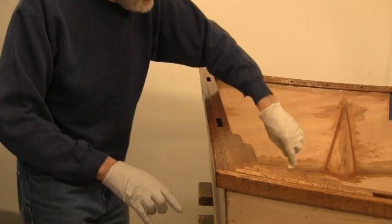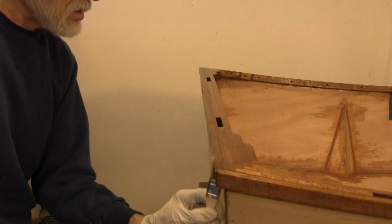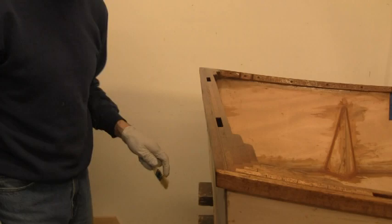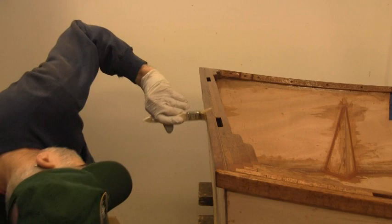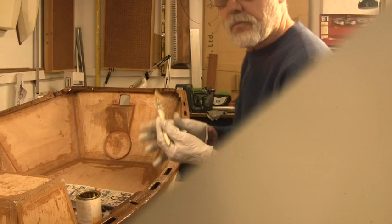When I get the little Milwaukee out with the triangle, I'll do some sanding on the parts where I may get some rundown from this spar varnish. Hopefully if I can drag it back and forth enough, it won't drip on me. I'll give it another two, maybe three coats total. There's only so much fun you can have watching these videos, so we'll be back.